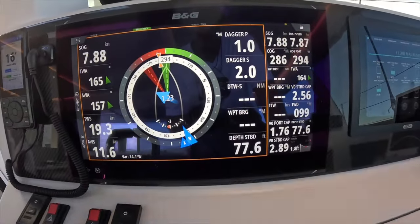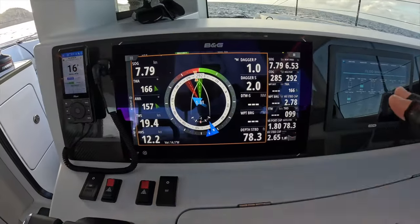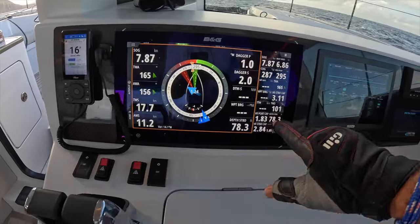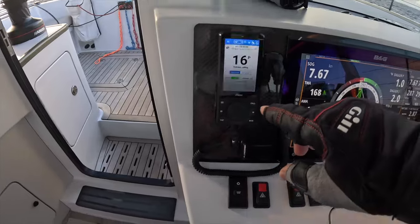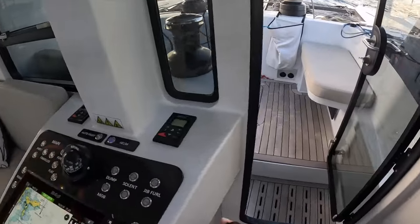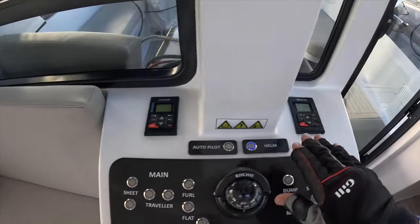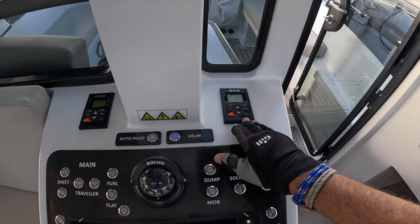This is part of our B&G system — the entire boat is B&G, Brooks and Gatehouse Electronics. It's an entire suite with a ship computer, and there are four screens. This is the main glass cockpit. This is the Vesper VHF AIS with a handheld remote. This is a B&G autopilot, and this is a second completely separate autopilot — separate drives, computers, and connections to the rudders. So if you're crossing an ocean and your autopilot goes down, you've got a backup. We rotate back and forth.